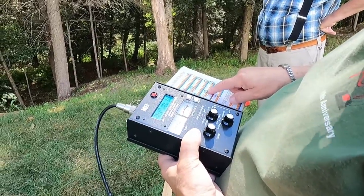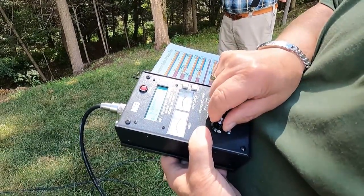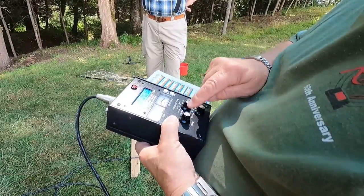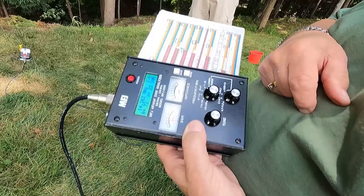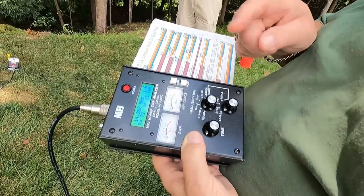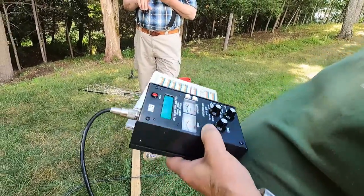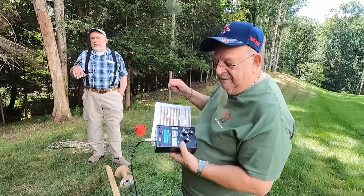Let's go to 14 — 14.225. There's a dead spot in this pot on the SWR meter; I need to shoot some contact cleaner in there. It could be a pot or a cap — something wrong with the control. Once we get the control cleaned up, at 7.238 MHz we're reading 1.5 SWR with a little reactance. Could be the coax or something, but very acceptable really. 1.5 — we'll be all set.